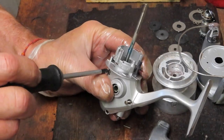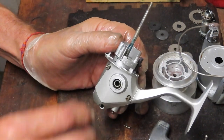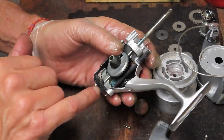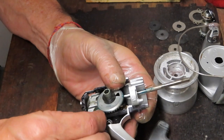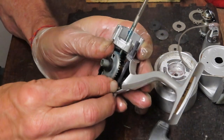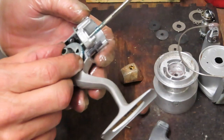Oops, just as I'm doing that, I'm reminded that I have that little clip by looking into my parts tray there. So let's take this out again. That little clip goes here to provide the tension on the swing arm for the override, so you've got to get that clip in there of the spring. You do that by compressing, and then we should be able to push this back in.